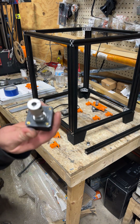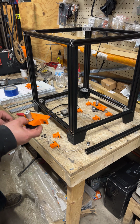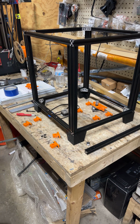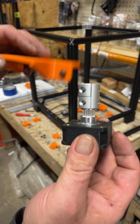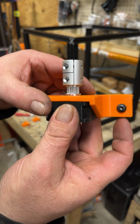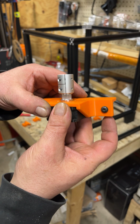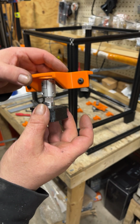So basically, now we got that with the heat inserts. And we're going to use the same M3 by 8s to mount that. And that'll mount the same way here. And if you'll take notice, see how this is right side up. The other type of Z that I do, this is flipped, and then there's a spacer, but see how you get the height there. Basically, if you're not perfect between both, as long as you're really close, it's not going to affect it, because it's like 400-ish millimeters across, and it's not really going to make a difference if it's a 1/4 millimeter from the stepper motor.